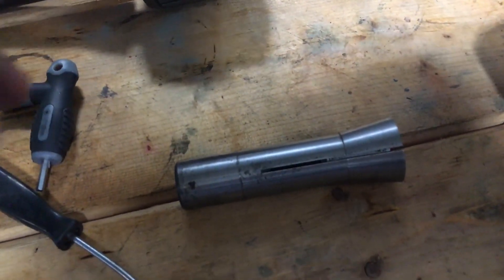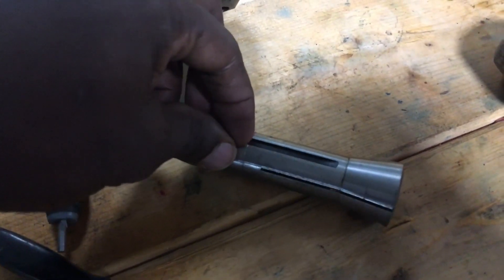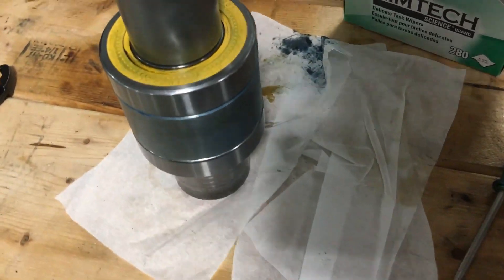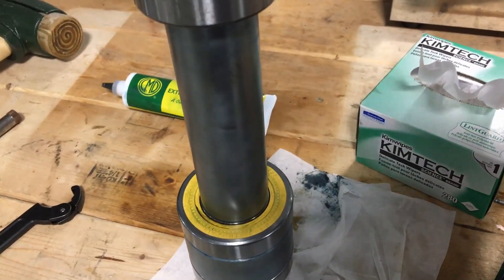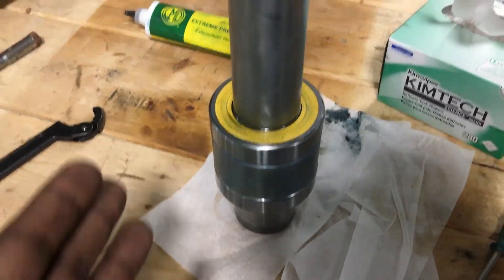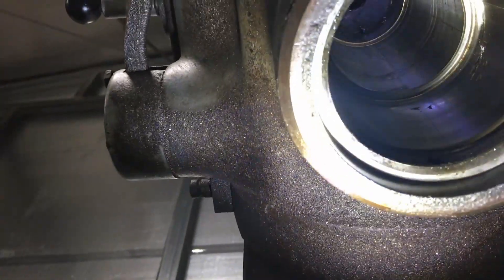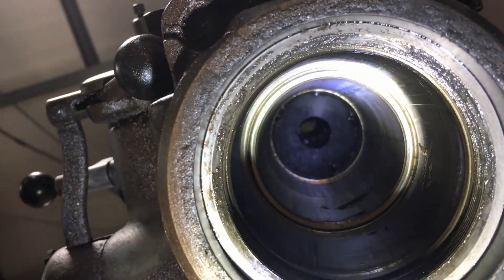I used my Jacobs drill R8 collet as well as a 7/8 collet to set the depth — I let it touch and then backed off about a quarter turn, then slid this in and out of the bottom end until I got it where I wanted. I'm not going too crazy on the spline portion because inside the Bridgeport it's nasty. When I fully rebuild the machine rather than just this refresh, I'll address that. I have to get the spindle aligned with the grooves in here.